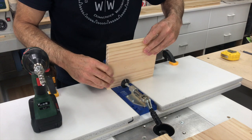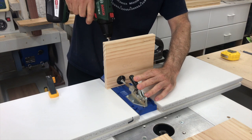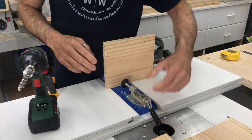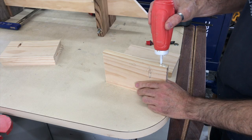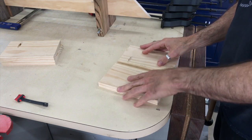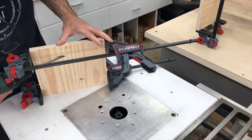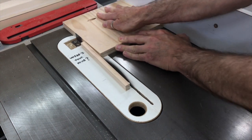For each side, two of the legs get joined together by a short apron piece, but the standard width boards I had weren't wide enough, so I joined two together using pocket hole screws. I then trimmed them down to final size by ripping the same amount off each side so the join remained centred on the board.